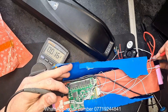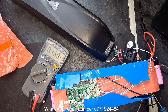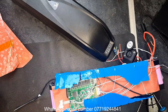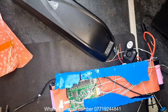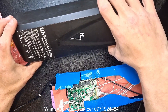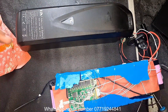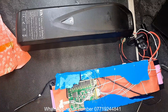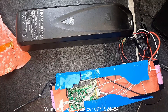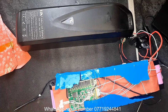Checking the charge port: 26.79 volts. Good news and semi-bad news — good news is the battery pack is perfectly fine and saveable; bad news is it needs a BMS replaced. The price range is between £9.99 and £22.99. I need to know what motor and controller are fitted so the BMS amp output matches the controller's input amp requirement. Apart from that, it's a straight BMS swap — next-day return. I'll send this off to the customer, see what they want to do, and get it shipped back ASAP. Thanks for watching — there are probably another three coming along later today.